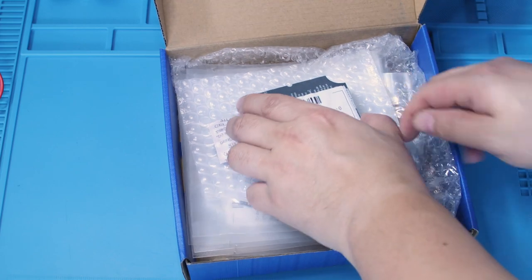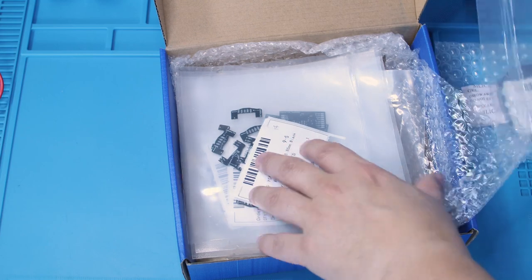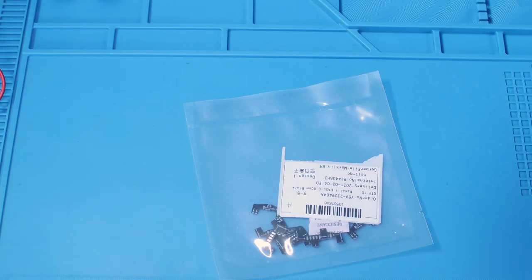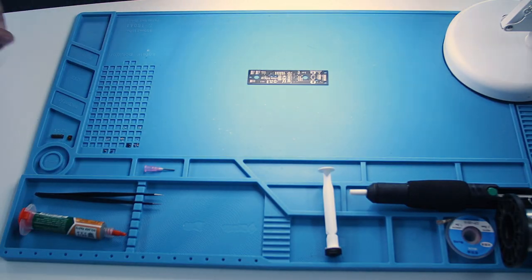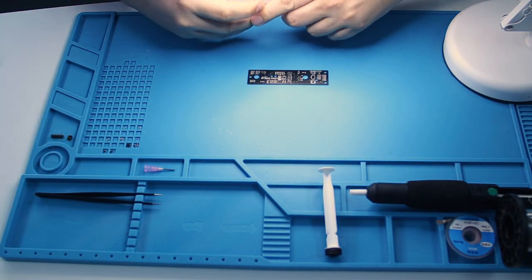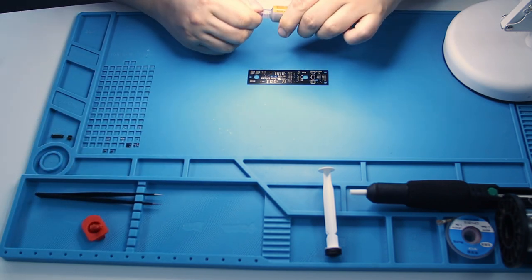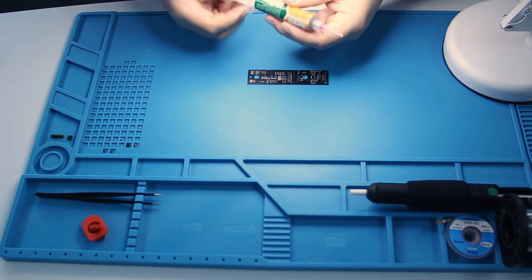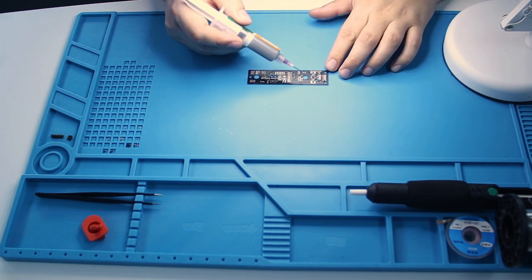The PCB has been designed in Eagle CAD and was sent to JLC PCB in China for manufacturing. The Märklin BR128 already has LED lighting installed from the factory, but I wanted to add a few new functions, like high beam and shunting light. The new PCB also allows me to install an ESU LokPilot 5 in a 21 MTC form factor.